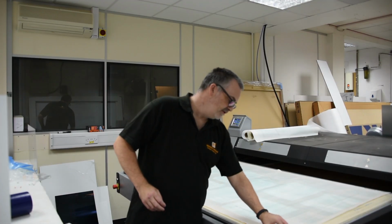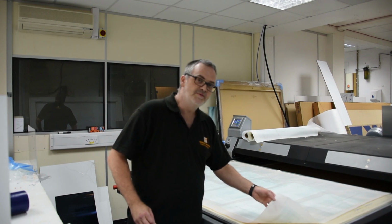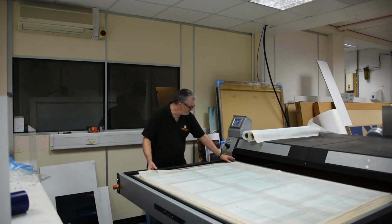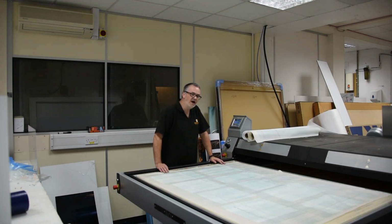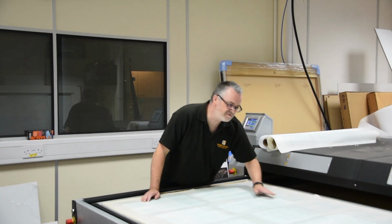Okay. This material is to absorb the moisture from the aluminium. I know that sounds weird, but there is moisture in the alloy. It sucks it out. It's quite a weird concept. What sort of temperatures does it get up to in there? It gets to 195 for this process. But I believe you can go hotter, but why you'd want to do that, I don't know. And it's going to run for 3.5 minutes.